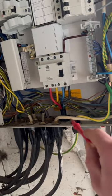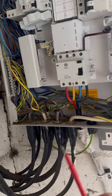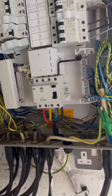It goes through a double insulated gland, so the earthing arrangement changes from PME to TT here. We've used the structural steels as the means of earthing, so there's an earthing conductor tagged onto a steel up there.